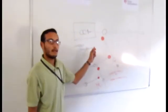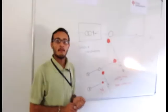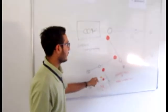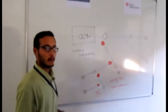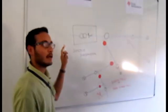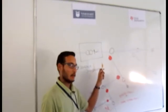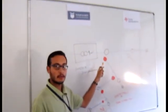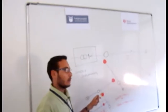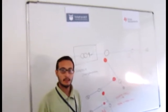This is the electrical power distribution network for the MV overhead line. When the fault detector is not installed and a fault occurs here, the line person goes to check feeder to feeder and closes the switch gear at each feeder. This takes a few hours and reduces the lifespan of the switch gear.